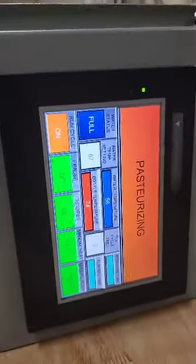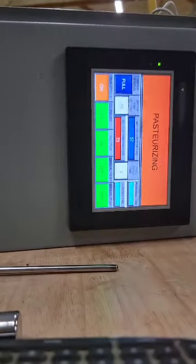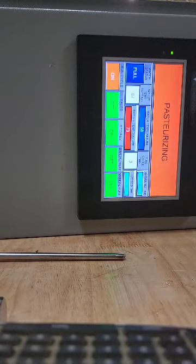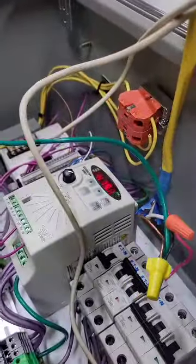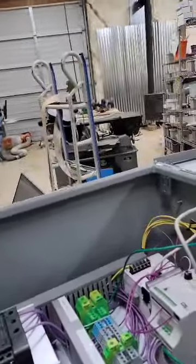You can see our lapse time is at one minute, remaining time is still three. We haven't been able to do much because we didn't have good water or heat. Pause also works — when I push pause you can see the motor ramping down. It shuts off. If I unpause it, it slowly ramps back up — kind of like a soft motor start. That makes it super nice so your motor doesn't use a lot of amps right at the start to handle that big exertion.